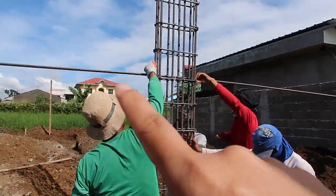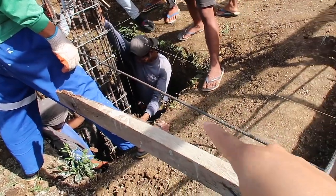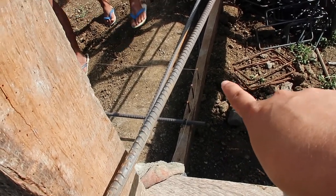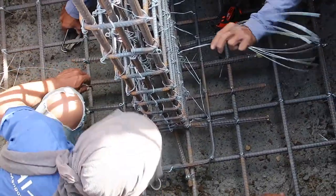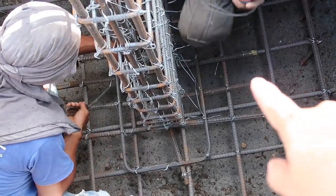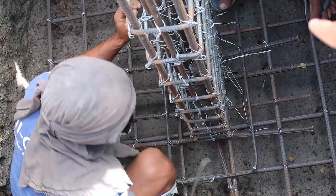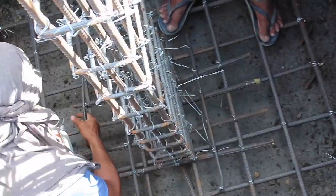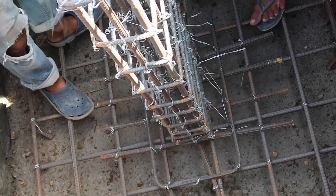They're putting a long rebar all the way to the other side, supporting each other, and then they also use another rebar on the side as support — and that's the marker. Now this is the second column footing they're doing. We requested to keep the primary rebar on top of the bedding, and we also requested to put a 12mm rebar around it. You can see the rebar in a U-shape on top of the 16mm foot of the column.